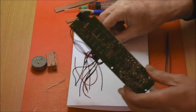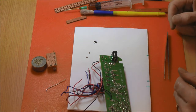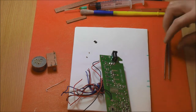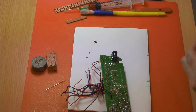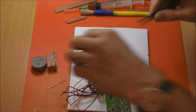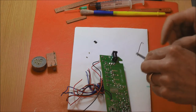What's surprising, I think, when I first started, as a kid playing with electronics, there was so much about heat damaging transistors, and I think a lot of them are germanium. So you'd have tweezers, and you'd have a little sleeve over it so it would hold the ends together, and act as a heat sink. You'd literally clip the other side of the joint before you soldered it to stop the heat going up.